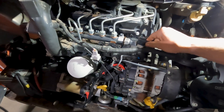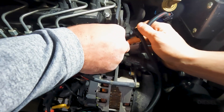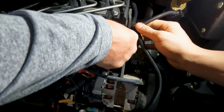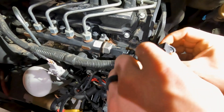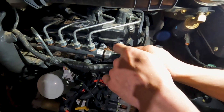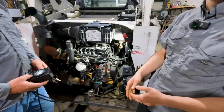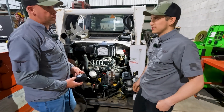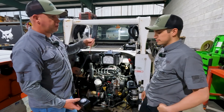We're going to unplug the sensor and hook up one end of our jumper harness — plugging one end into the sensor and connecting it to the gauge. We're also going to tee in the sensor so we don't throw any codes. The machine can work like normal, because if your sensor is unplugged the machine thinks you're at max rail pressure and it just doesn't work — it'll send us to like 30,000 psi.